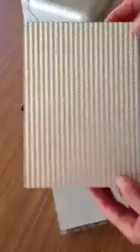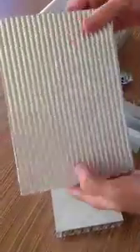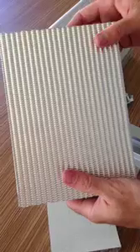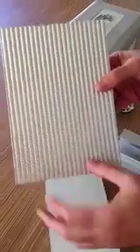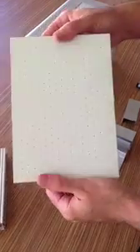Then you have the 2071B panel, which has a slightly more corrugated finish and controls noise from 100 Hz right up to 10,000 Hz. So if you're looking for broadband noise control, you would go with this panel. If you're looking for just low frequency noise control, you would go with the 2071A. Both panels are made from 5000 series aluminium honeycomb.